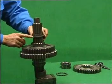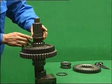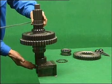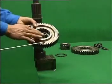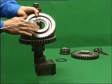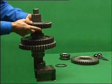Pull the adjusting gasket through main shaft to the third wide groove. With its convex side downward, rotate the gasket, move the hex key upward. Install second speed gear and spline gasket with the contact teeth downward, facing sliding clutch. Embrace the spline gasket so as to prevent it from dropping out.